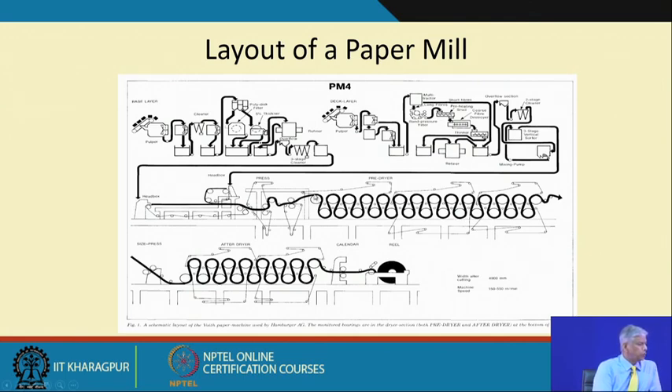Eventually the paper has to be slowly pressed and then dried. These are big rolls where dry steam is put in — steam dried. Each roll could be close to a meter in diameter and 4 meters wide. So you can have 4-meter sheets of paper coming out through many dryer rolls. After the dryers there is a sizing press, then more drying, then calendaring — which is like ironing your garments — and finally the pope reel where everything is taken off.